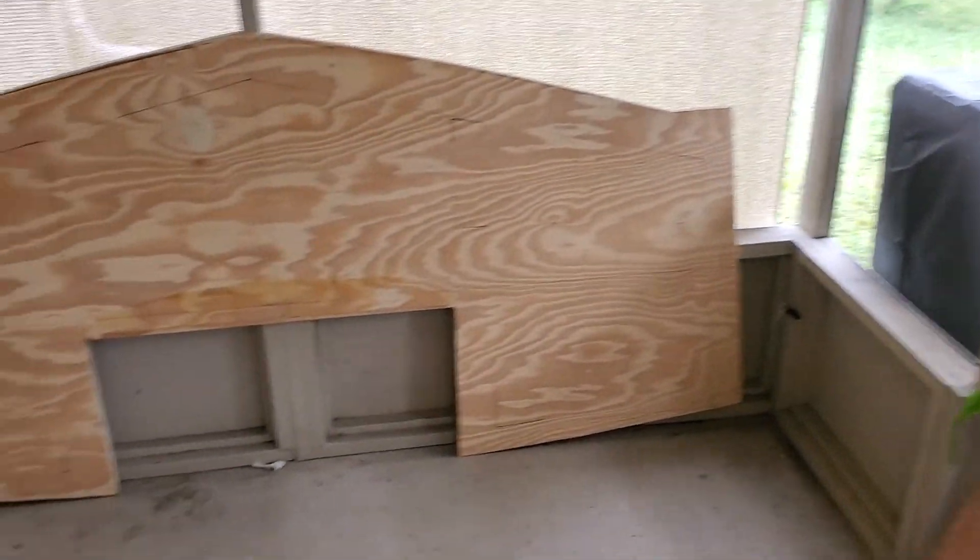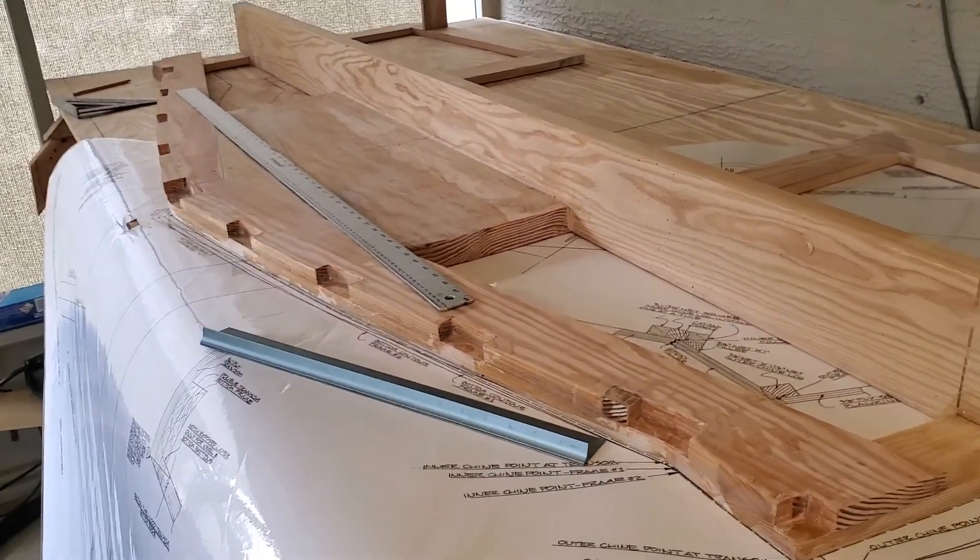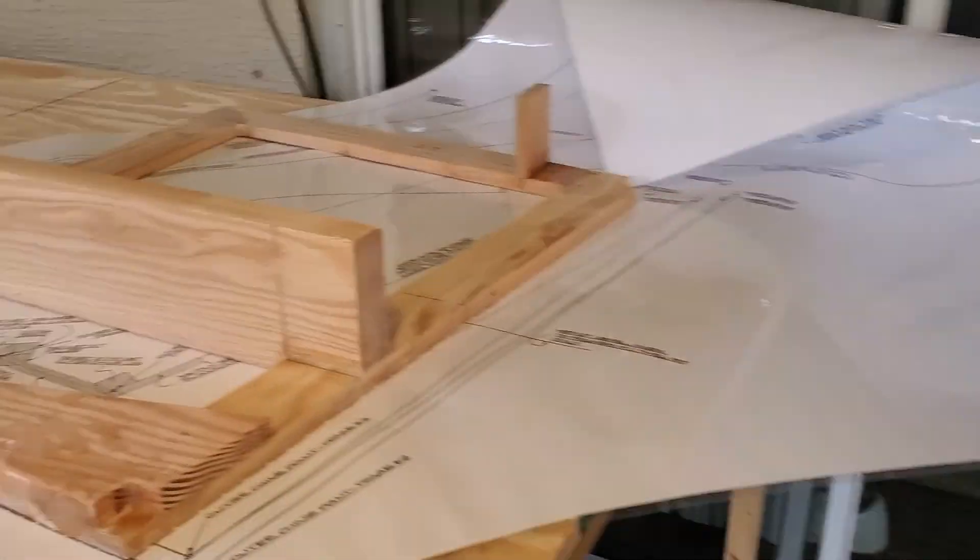The wood will be covered in epoxy. I'll be doing that to all the frame members before going outside to sit in the elements. I have not attached the plywood to the transom yet, because that transom alone is pretty heavy and I don't need to make it even heavier. So when I have the strongback built, I'll attach it then — I'll have the transom frame in place, dismount it, mount it on the building board, glue it up, and put the whole thing back on the strongback in one shot. So that's the progress. This is the Glenel and this is the Schnook — we'll see you next time.